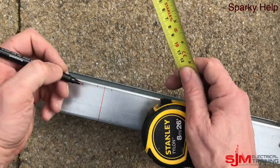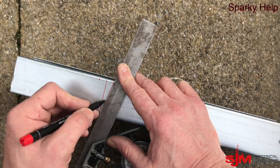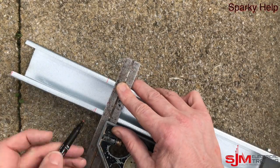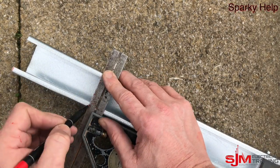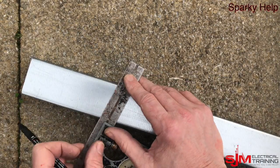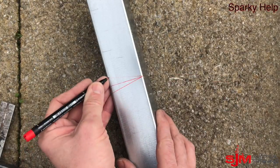So work 10mm either side — you can decide whatever you want. Obviously the smaller the cut the shallower the angle. And make sure you go in the right direction — so is it going up or down, or left or right, or whichever direction you wish it to go. Mark it all the way around and I am just going to cut out those bits there.